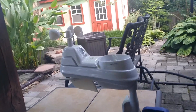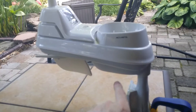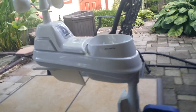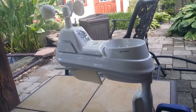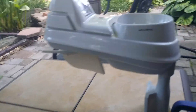There are four screws in the bottom of this unit that you can take out. You have to be careful not to take the two that are sort of in the center, but the four around the outer periphery. The two in the middle are used to calibrate the rain gauge, so if you mess with those, you're going to mess up your rain readings.